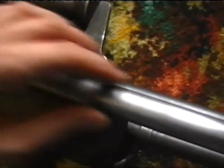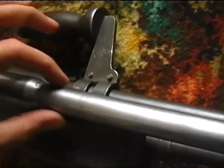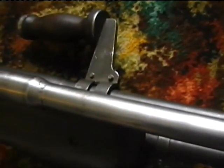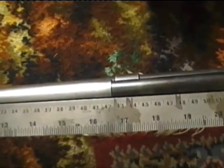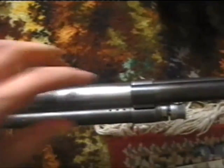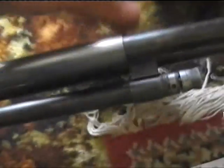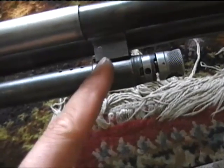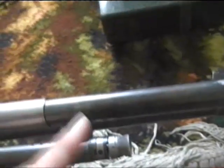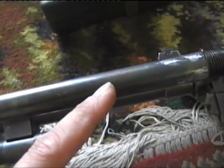I've used the curtain rod, which I showed you in, I think, video 1 right at the start. I had some mild steel curtain rod. Now I've used that, and I've taken it from the receiver there to there, 42.2 millimeters. Now that basically takes you up to this mounting here, which holds the gas pipe underneath, the gas return pipe. So basically after that point I've just got a 2 centimeter, 20 millimeter diameter pipe.